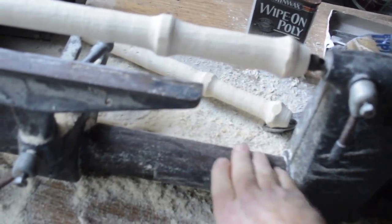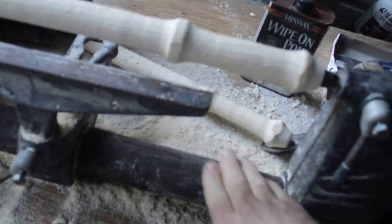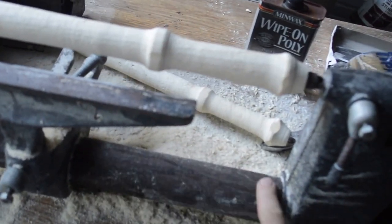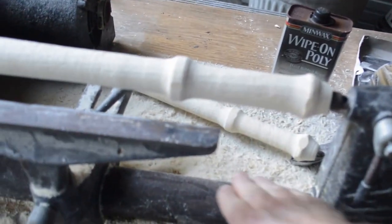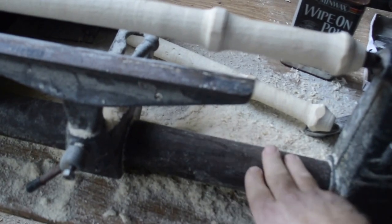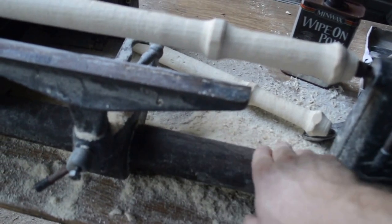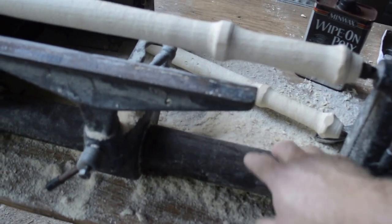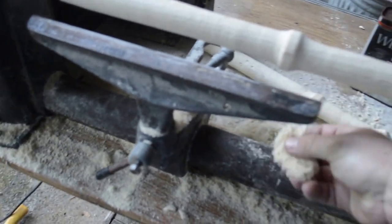It's still a little rusty, but I put some rust remover on there — some phosphoric acid — and then scrubbed it out. It's not really pitted, but it isn't smooth and shiny like it should be. Then I put some lithium grease on it because I didn't want sticky oil on there because of the sawdust.